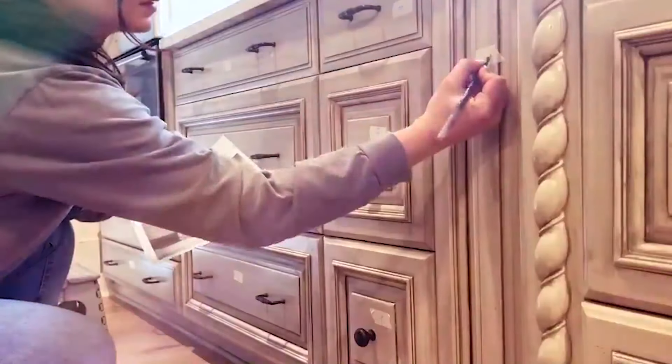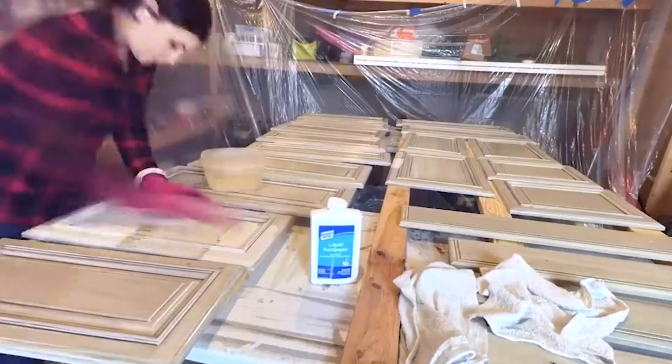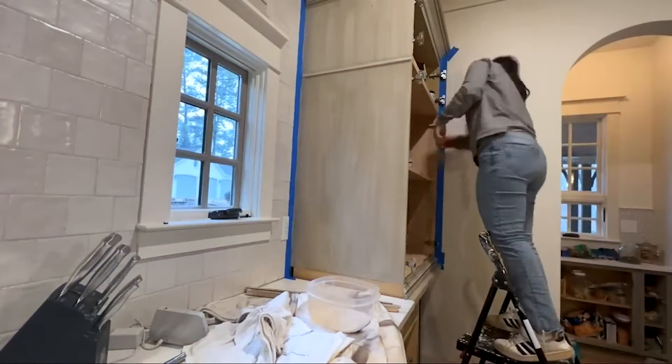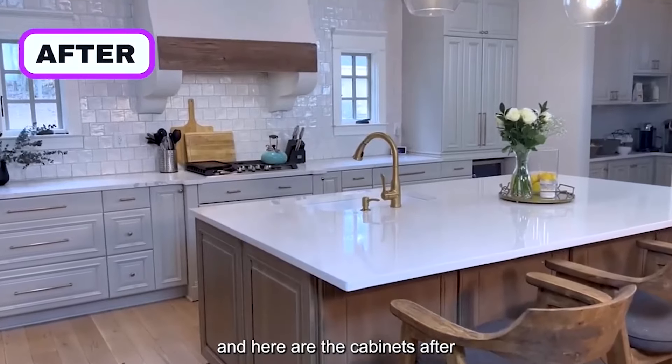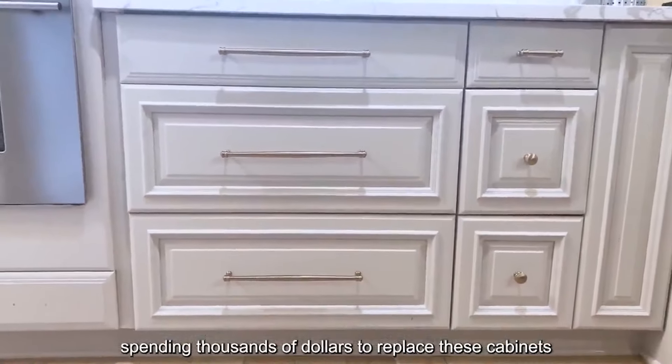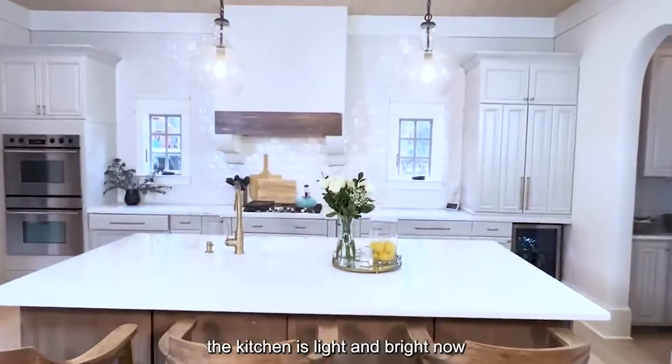The last and probably my most popular DIY project is painting all the kitchen cabinets in the main house. Being the third time approaching cabinet painting, I really wanted to do it the right way: I took off all the door fronts, used liquid sandpaper instead of sanding, primed them, sprayed them, and changed all the hardware. It made such a difference. I'm giving this a nine out of ten because I've noticed a little chipping — especially on the drawer pullouts where they rub — but it completely transformed the space and was totally worth it.